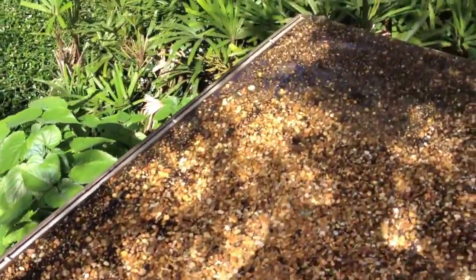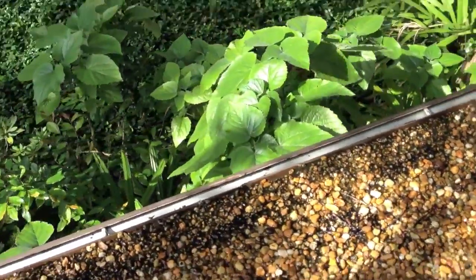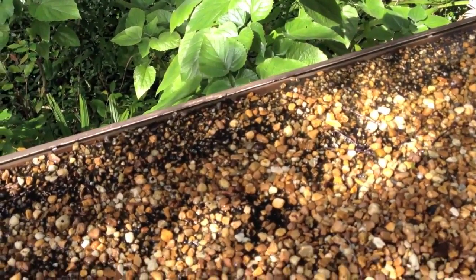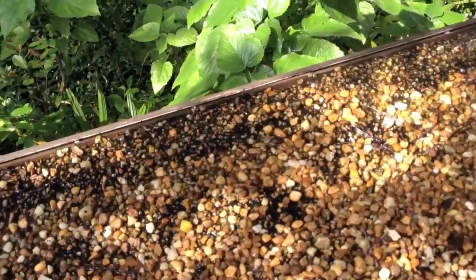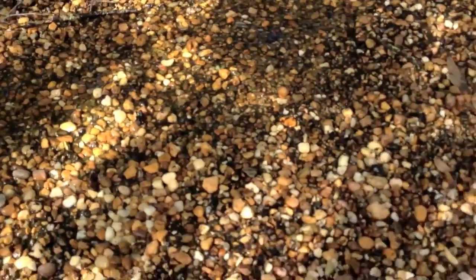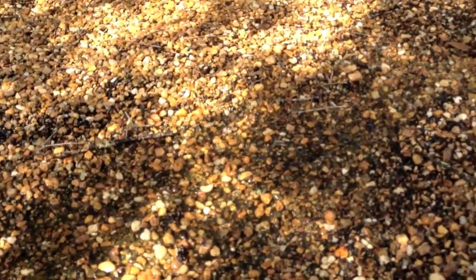On the opposite corner of the carport, a lot of water is being retained where the gravel stop is at a higher elevation than the field. In the middle of the field, because of depressions in the roof, water is also being retained.